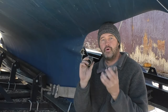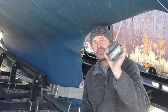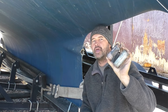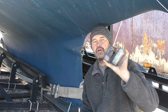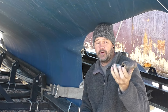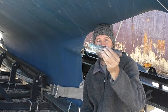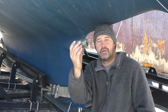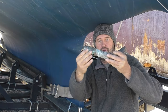When I pulled these cutlass bearings out — and by the way, why are there two? Is this normal? Everything I've read suggests just one four-inch cutlass bearing in there, but I ended up taking out two. They were stacked back to back inside this stern tube.